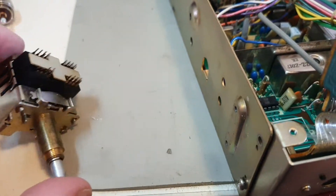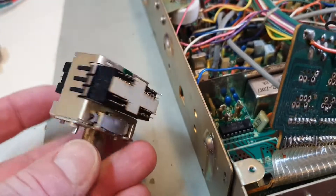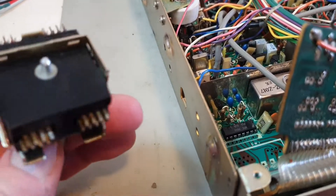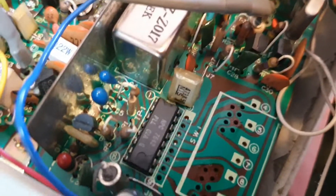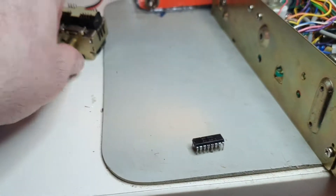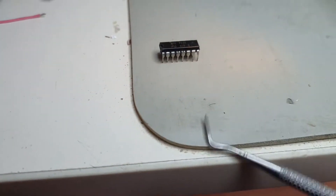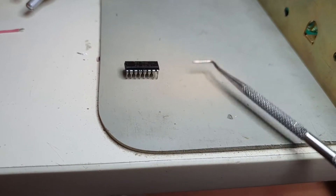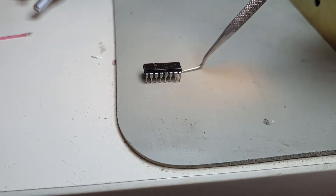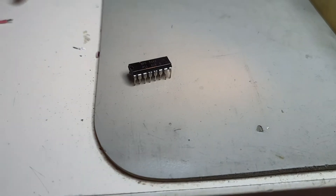The next stage is to clean the pins with isopropyl alcohol on a brush and apply a couple of drops of oil on the mechanism. Then I'll remove the o2a chip and put the chip holder in. Tech tip for removing o2a chips: I use a dental kit with the right-angled tip — because everything is desoldered, I just put it underneath and pry up on both sides and the chip comes out quite easily without damaging anything.